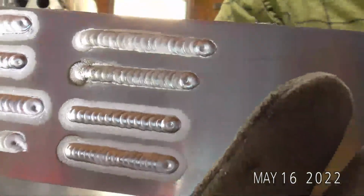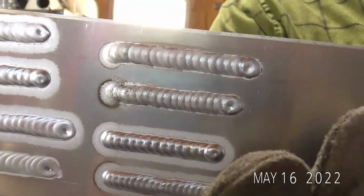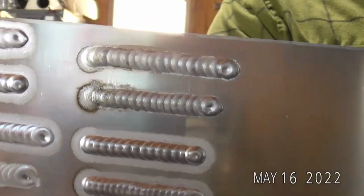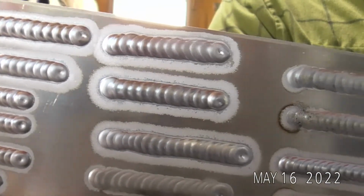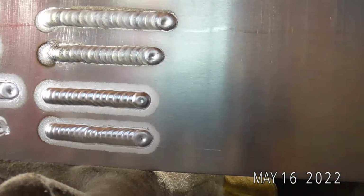The weld's very grainy. You can almost see the oxide layer still floating on top of the bead. A little bit better start on the second run, I think because I was still having my post-flow run over that start. Now that my post-flow's done, if I went back and started again, I'd have this real sooty start. But yeah, if you're looking like this, that's too low a gas flow. If you've got a super wide etching zone, that's going to be too high gas flow. Also, the starts are real erratic at that high gas flow, which is more apparent on the gas lenses when you run too high.